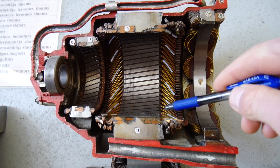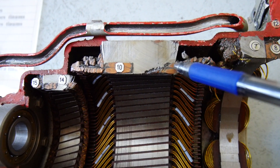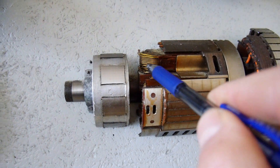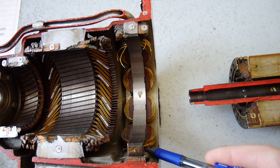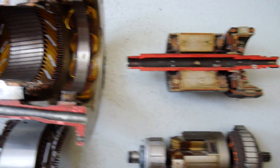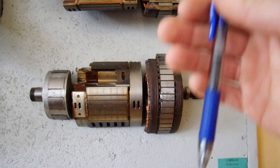This is the armature winding of the main generator. These are fastened inside in the slots, and the cross-section area of the armature windings is much bigger compared to the field winding. These coils are the field winding or poles of the primary exciter — these windings are north, south, north, south, and so on — poles which generate static magnetic flux in which the primary exciter is rotating.